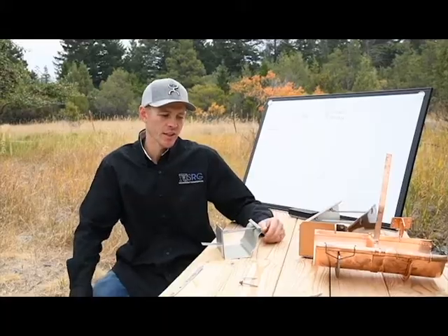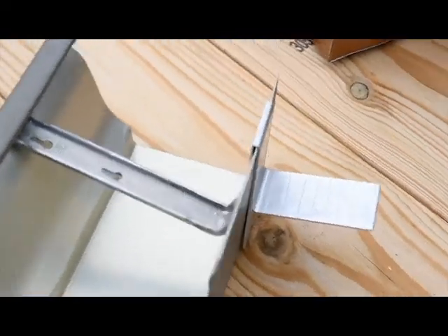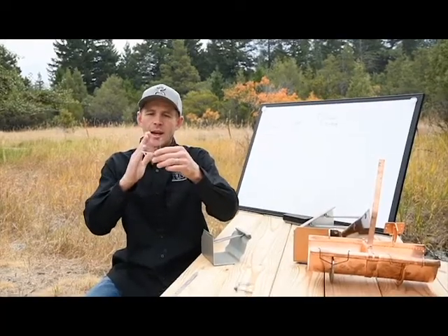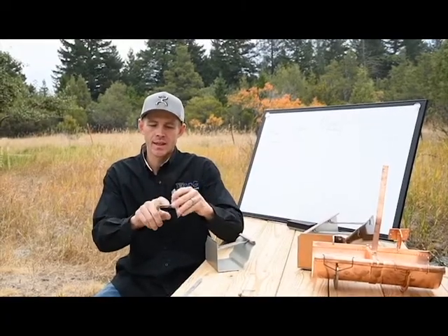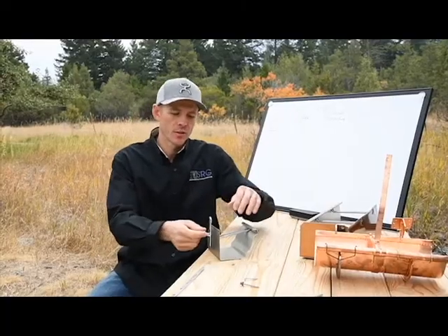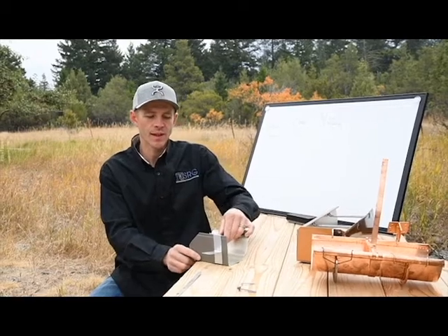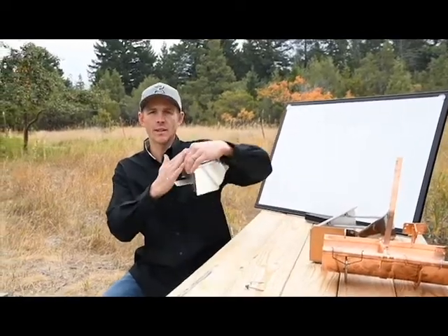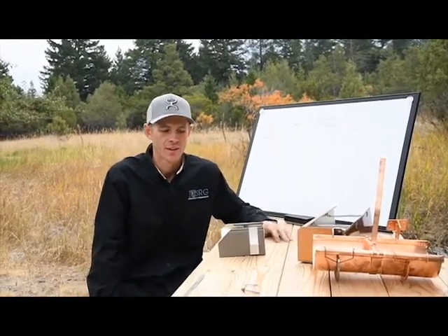Now we'll move on to the T-wedge — this is a Truss T-wedge. They're adjustable and have notches in the back. I usually put this up against the fascia, trim it back, and put my level on the face to get the back of the gutter plumb. Once you get that level and plumb, that tells you what mark you need to cut all your T-wedges on. You cut all your T-wedges, throw them on the gutter right next to the hanger so it pinches the top next to the fascia. It's an adjustable way to deal with angled fascia.